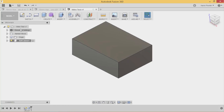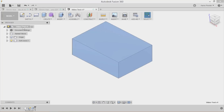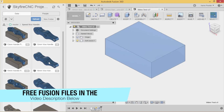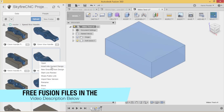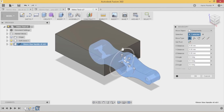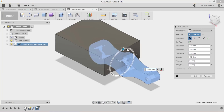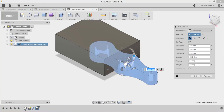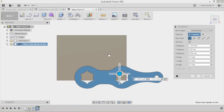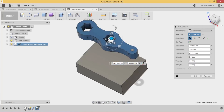I'm going to get out and click at the parent level up the top, activate it at parent level. I'm going to come over to my data panel, right-click on the part I want to insert, and choose Insert Into Current Design. Wait a minute for Fusion 360 to go to the cloud and bring that down — and it will populate here. I'm going to rotate it — you can see that it was drawn in a Y-up orientation so I need to rotate it before playing around with it. I'll move it up a bit and roughly centre it just by looking at it, then click OK.